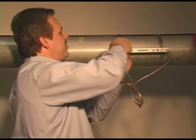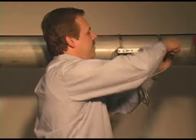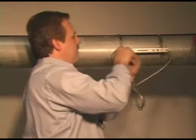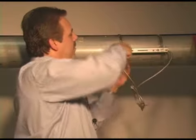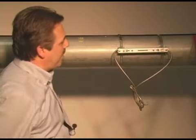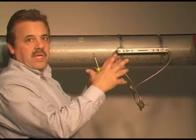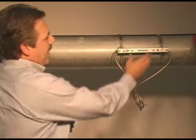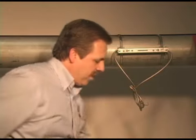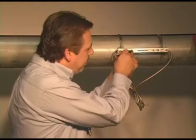So it really fixes the amount of force that we're applying with the transducer on the pipe and up against the coupling pad, and we have the perfect amount of force. We can handle vibrations well if there's some expansion, contraction of the pipe. And that's it. We're all set. You might want to take a little peek under there. Make sure that your coupling pad is in place.